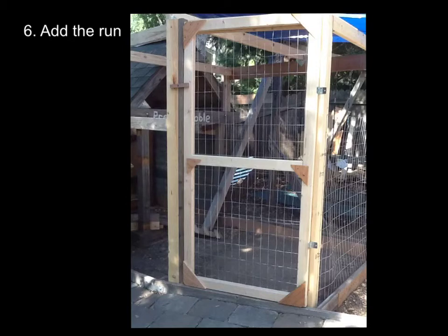And here you can see where I'm framing the run. I put the old decking down on the floor, and then about an inch and a half above that is where I attach the lumber to give it some strength. I have a big 4x6 underneath the door. These are 2x4s — two of them in an L shape running up — and I've got 2x6s going this way. It's a nice big frame. The door is big enough for me — I'm six feet — and I can walk in without ducking. I wanted to make sure that could happen.